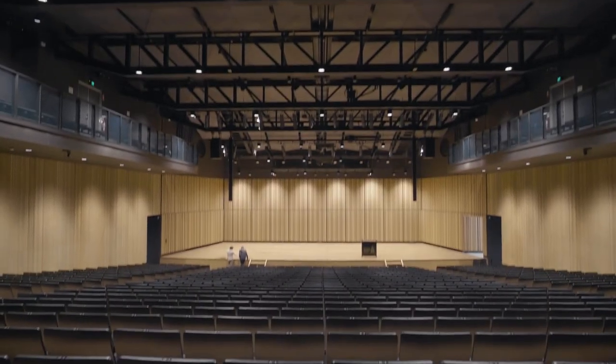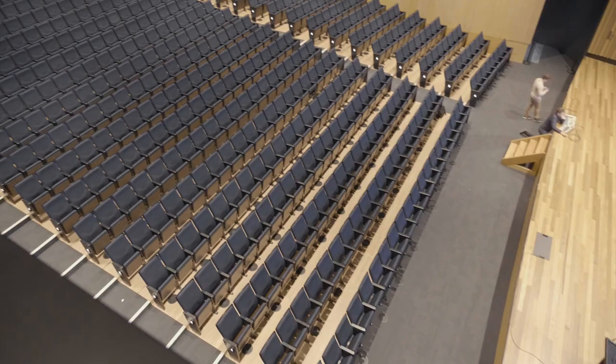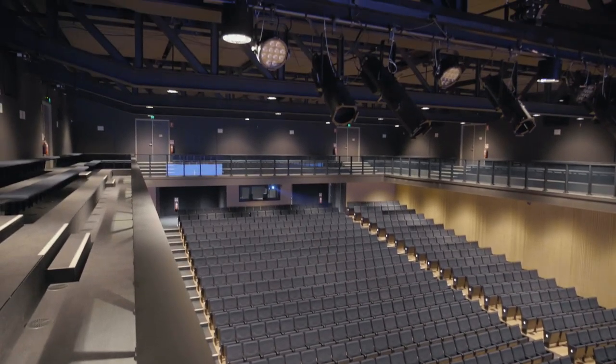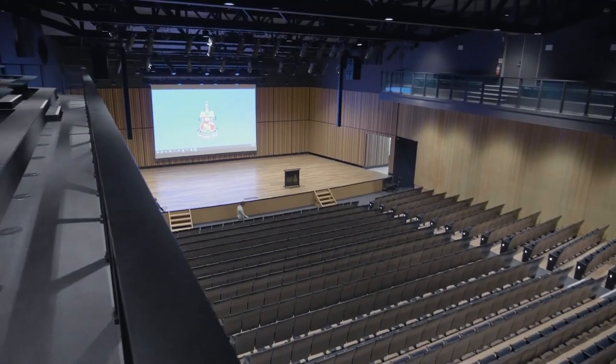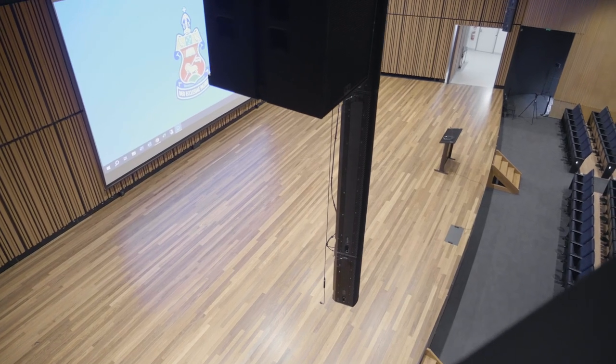Once we got in this room and I realised just how reverberant and how live the room was, I knew that a line-array system was never going to be the best option and a beam-steered system was a far, far better choice — because you can really pull that audio off the walls, off the back. You can shoot it straight at people. When you've got a reverberant space like this, which actually acoustically sounds really incredible, the intelligibility was not quite there where PA reinforcement was really important. So the fact that we've got the beam steering stands out particularly well with the FON — we get great clarity throughout the space.